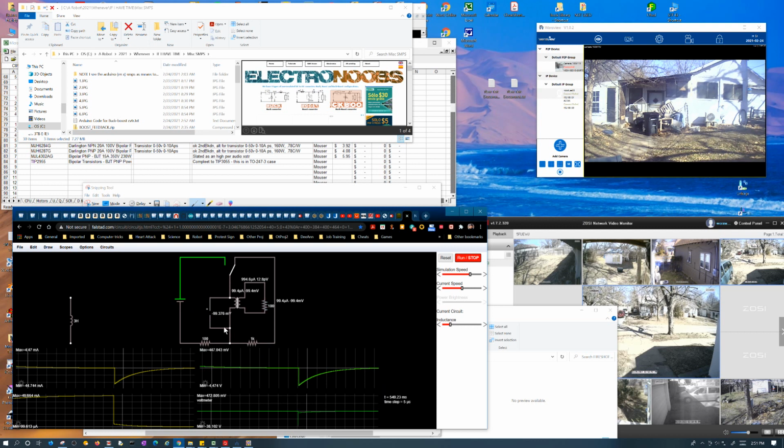If I change this voltage, of course, it would generate a different output voltage unless I adjusted the resistor to equal the same amount of energy stored. And if this had the same amount of energy stored in it, it would generate the exact same result you're seeing here. So don't get confused by that. That's immaterial. It's all a matter of how much energy is stored in here and what rate you allow it to release when you're looking at what kind of voltage is generated in this arrangement.